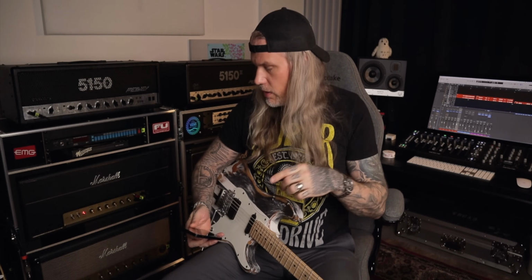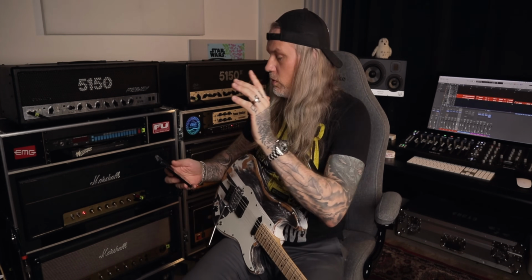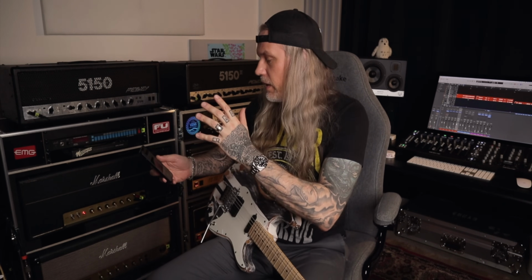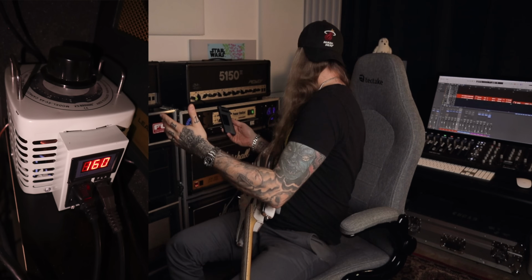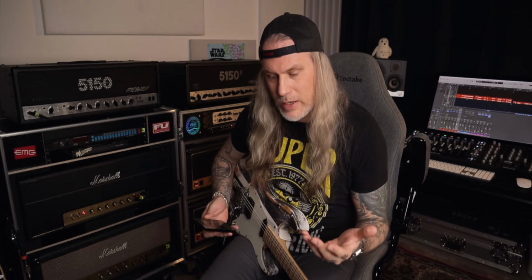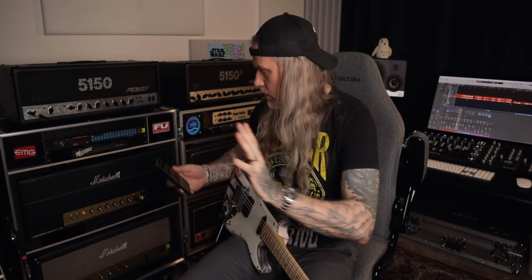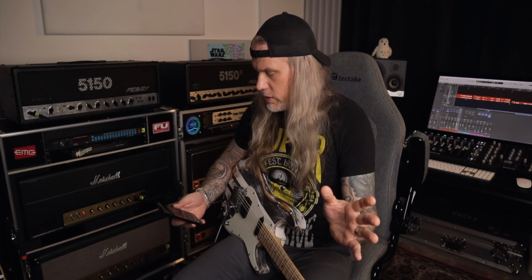Okay. All right, back in my studio again, and now what Eric did to the amp. So just to recap what's been done. There are the 6CA7 power amp tubes, and they are biased to use with the Variac at 160 volts. So I'm lowering the voltage from what I get here, which is exactly 220 to 160, which is approximately the same as if you would lower from the American 120 volt power to around 90. So 6CA7 tubes biased accordingly with the Variac on 160 volts.